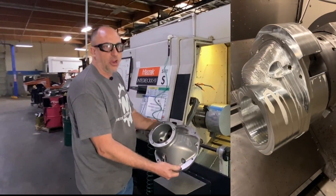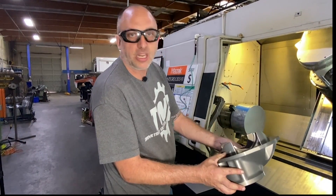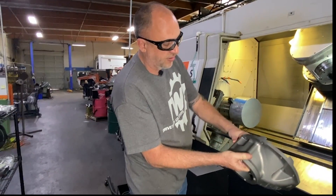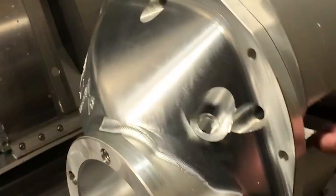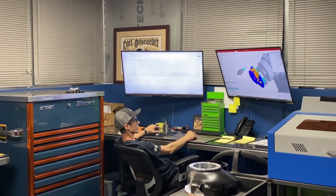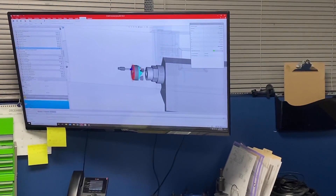Here's a completed part that's already been post-processed and plated — the exact same part that we're making here. You can see the level of machine work on this. The tool paths are very precise. This is a seven-axis machine. With this part, we just started using Esprit TNG — it's a CAM software package. Now we're utilizing full 3D models and converting that directly into tool paths. That's a new transition for our business.